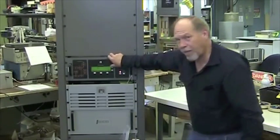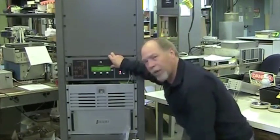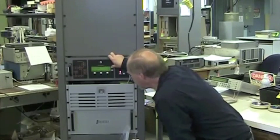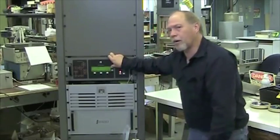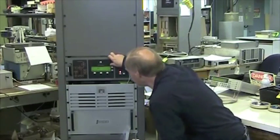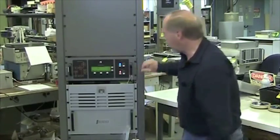At approximately 500 watts, it's going to switch to its highest B plus setting of 350. And it did that. 359. Average DC current typically into a good load is 3.4 amps at 1,000 watts. And this one's a little low, so it's 3.2 amps total DC current.